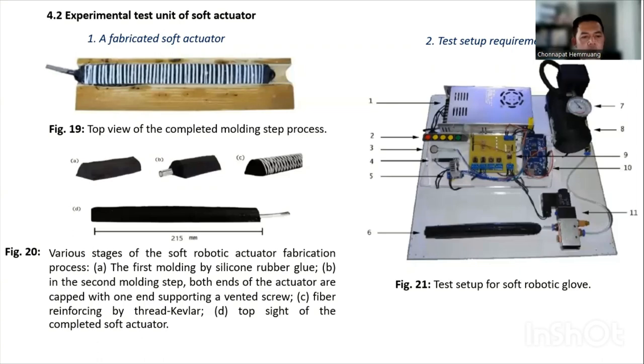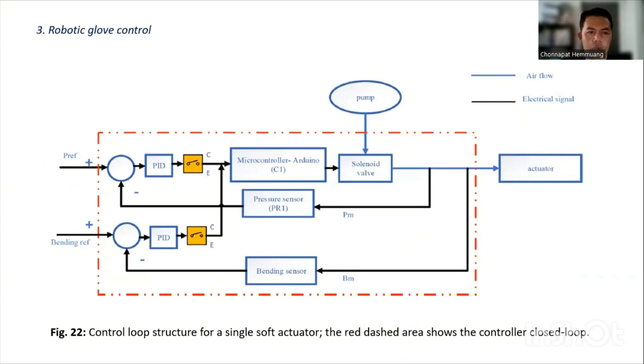The soft actuator weighs 45 grams. The design glove weighs 120 grams and can lift 6 kilograms without assistance. FIG-21 shows the test setup for the soft robotic glove. A soft robotic finger could be controlled in an open loop or closed-loop system. There was no feedback mechanism in the open loop system to provide a measurement signal. The open loop control system uses key pressure paths to give a common input to the soft robotic finger for bending and extension, not requiring sensor feedback. A closed-loop system with a pressure sensor was employed to measure the pressure and angular position of the finger, with the obtained signal used as feedback. The closed-loop control system is depicted in FIG-22.